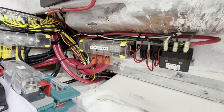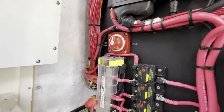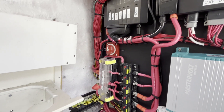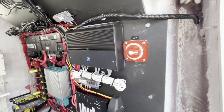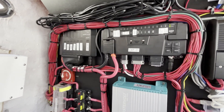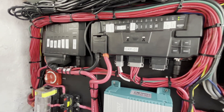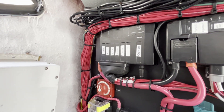We've got 24-hour power here on the big 600-amp bus bar, and switch power on this big 600-amp bus bar. There is a battery parallel — that's special for this boat because it only has two batteries on it, and this little battery actually can crank small engines, so we're going to allow the customer to do that in very special circumstances, which is why the switch is kind of buried. We have a master house switch, which should be on when they're using the boat. We have a C-Zone Control-X Plus with 16 circuits controlling lights, fish boxes, pumps, and all the stuff on this boat, and then for higher amperage, we have a Contact 6-plus doing stereo amplifiers and other loads.